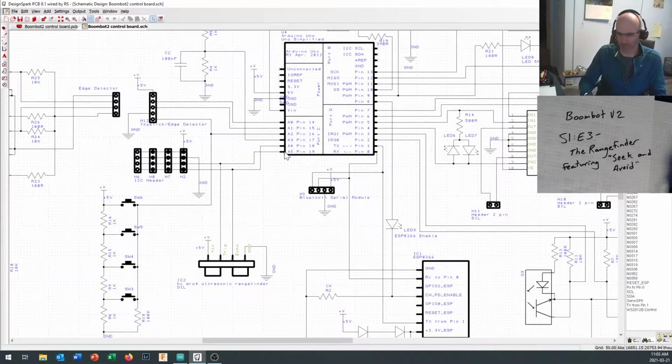And there's lots of things. We could put temperature sensors on there to read analog voltages, but I've specifically chosen A4 and A5 for the rangefinder because you can see I've also got these tied in to a few other headers on your board. And those other headers are on there for a later higher level project where we're going to remove this ultrasonic rangefinder and replace it with a laser rangefinder or possibly multiple laser rangefinders.